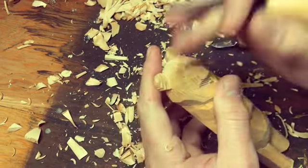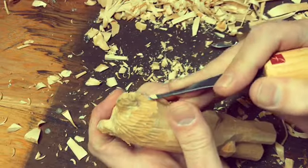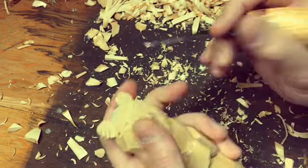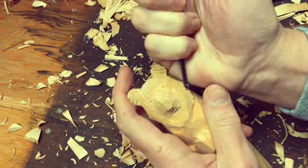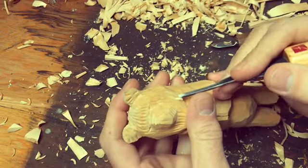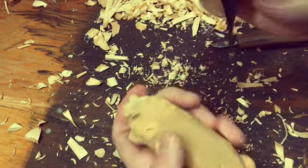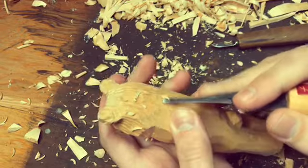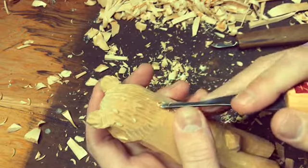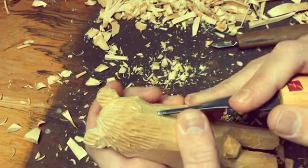It's just you have to take a lot more surface off. Basically, take off all of the cut. If you kept going over these cuts with just this tool, it would have a funny look. They have to have that clean flat spot in between and be separated for them to look like you meant to do it. And I want this flat spot kind of here, this broad space, so I'm really trying to dolphin it out, because the wood's not going to do it for me. Only when you're on a peak does it cut the best and cleanest.